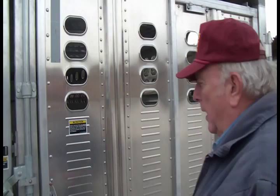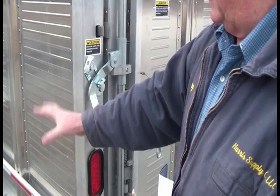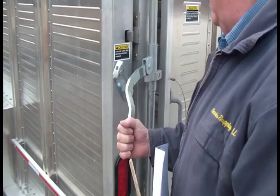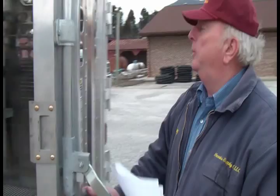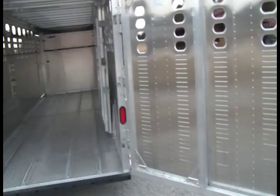On our tailgate, the lever is tucked back here out of the way — not sticking to the side where a nearby post would prevent you from unlocking it. It operates on cam locks like on your big road tractors, locking at two points. There's a slam latch system for quick closing when loading cattle. The door swings all the way around and touches the fender well, so it can't get hinge-bound by wind, a cow backing into it, or anything like that.